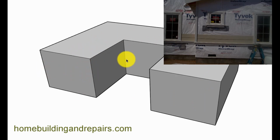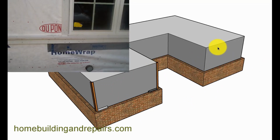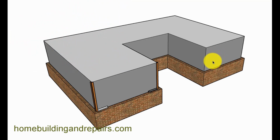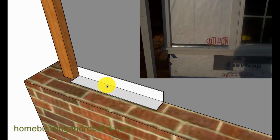And the exterior is finished with the building paper. Building paper goes from the top of the wall to the bottom of the wall. So if we had a brick wainscoting around it, the building paper would go all the way down to the ground. Any water that got behind the siding or behind the finish above would simply leak behind the brick without some type of metal.